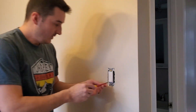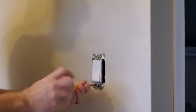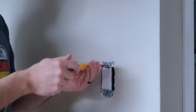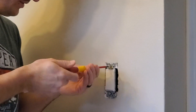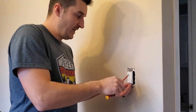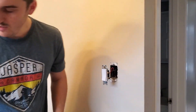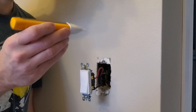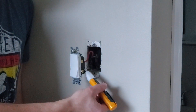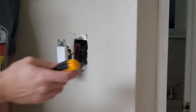Once the switch is out, one of the first things to do is find which breaker or fuse the switch is fed from. A very simple way to do this — I have my helper downstairs and he's already got the breaker for me — but a simple way is to leave the light on. Pull it out a little bit to show you the wire. I have a pen tester here; that's a very handy tool to have. I'll put it on the black wire, and as soon as it's off, you know it's safe to work with.